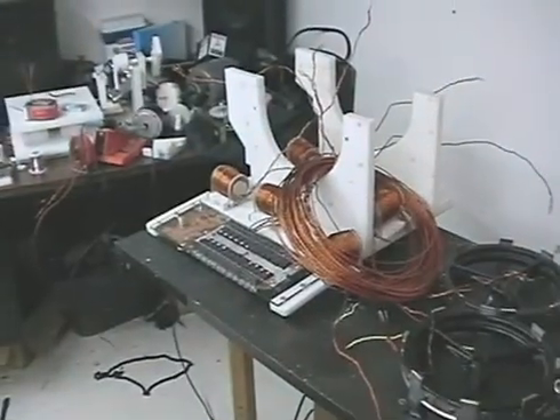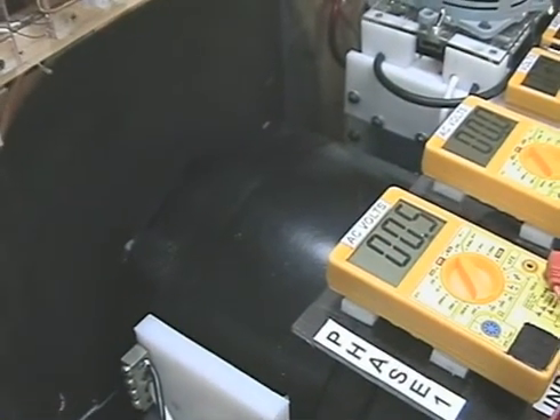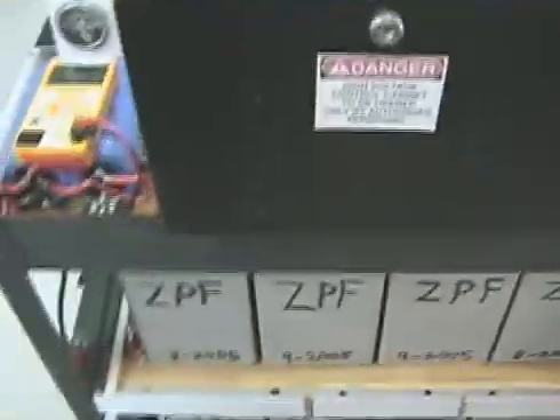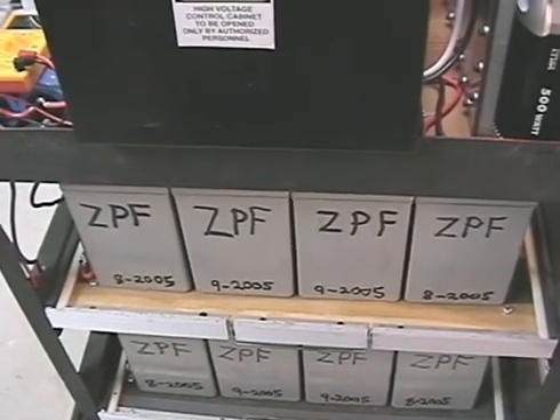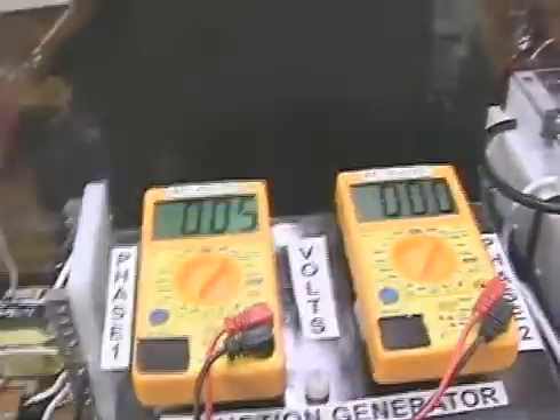The original VMG is pretty much toast — it's been disassembled. We rebuilt a larger motor, which is the heart of an induction generator. It's a 3 horsepower polyphase, 3-phase motor. We've wired it up. There are two banks of 44 amp-hour telecom batteries — 8 of them. Right now they're only being charged; they're not driving the device.